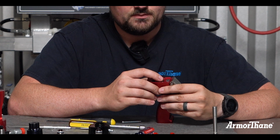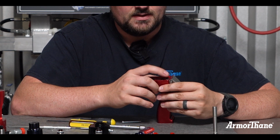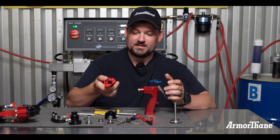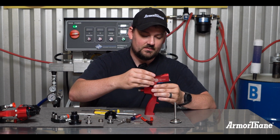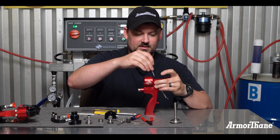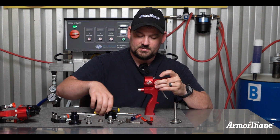Those are also with the pneumatic side of the gun, so rarely will they need to be looked at. But there's 3 of them that stack like that. When you reinstall this, there are little indentations where those O-rings go, and you'll just place this on top, and then slide these back into place without trying to move it too much.